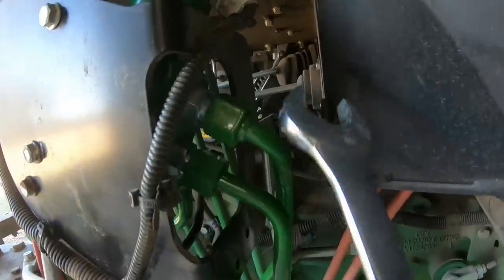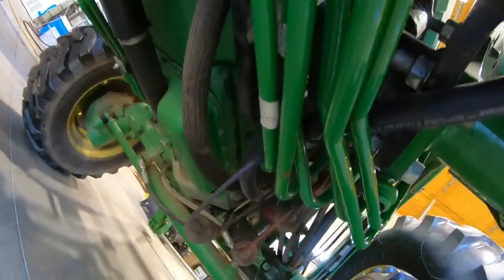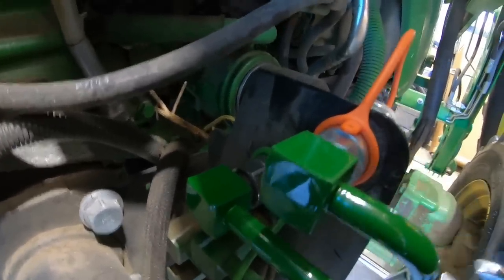So there's the backside. We're connected to the valve. The hard lines go down, run underneath. Again, very straightforward process. Go up toward the front loader arm mount, come right back around and thread into the backside of those couplers. That's where you put that O-ring, right on the front of that hard line right there. Kind of hard to get in there and tighten everything up, but eventually you can get it figured out with the right tools. And you're essentially done as far as all that goes.